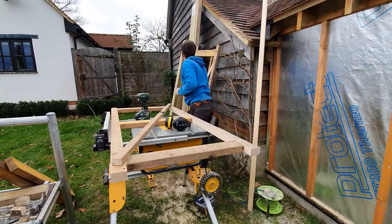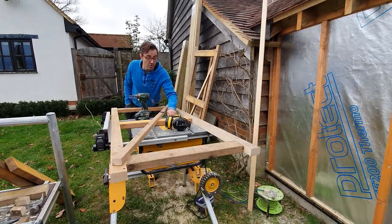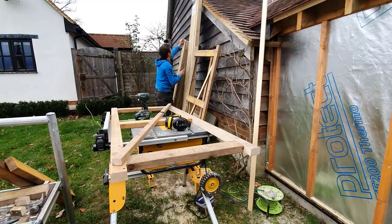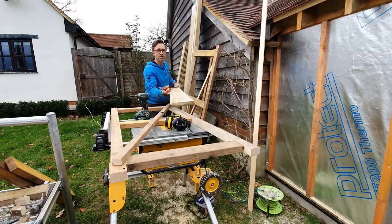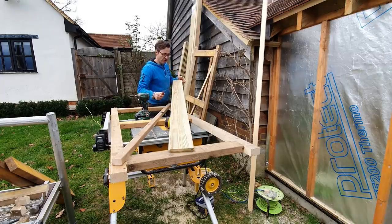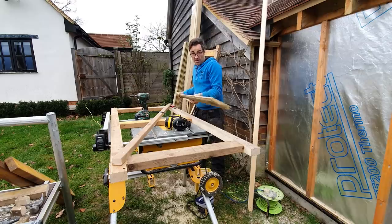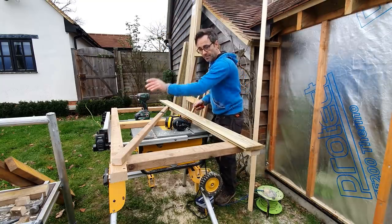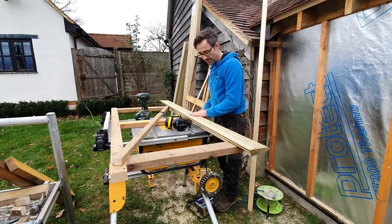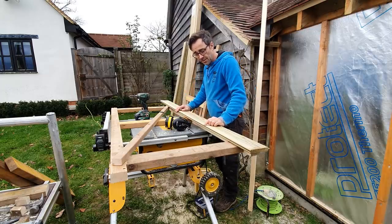Now I'm using a cladding, which is redwood. It's beautiful. Redwood is basically what we use for joinery quite a lot of the time. It's a tongue and groove redwood. It's really clean. It hasn't got a lot of knots in it. It will have knots, but this particular piece hasn't got a lot. And it's pretty thick as well. It's sort of 25 mil, finishes about 22. The idea is it's going to be clad all over the face, top to bottom, and it will just look absolutely brilliant. Just pinned on as per normal, dovetail pins, and it'll look the business.